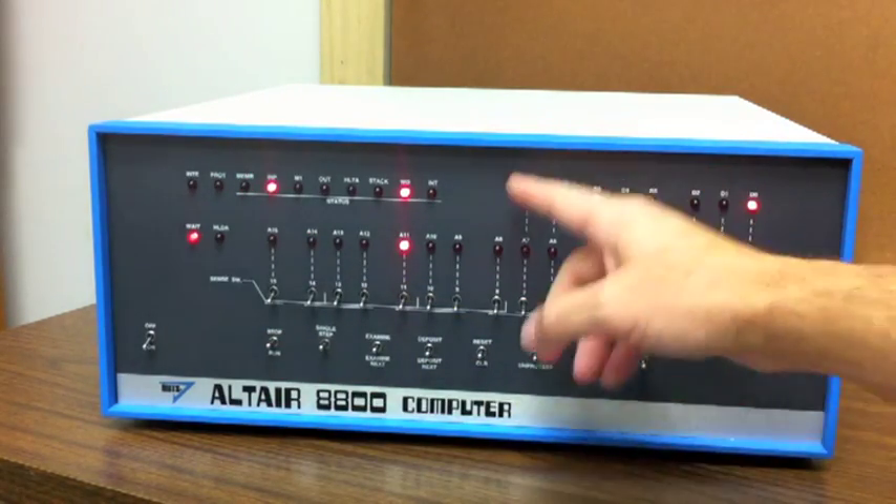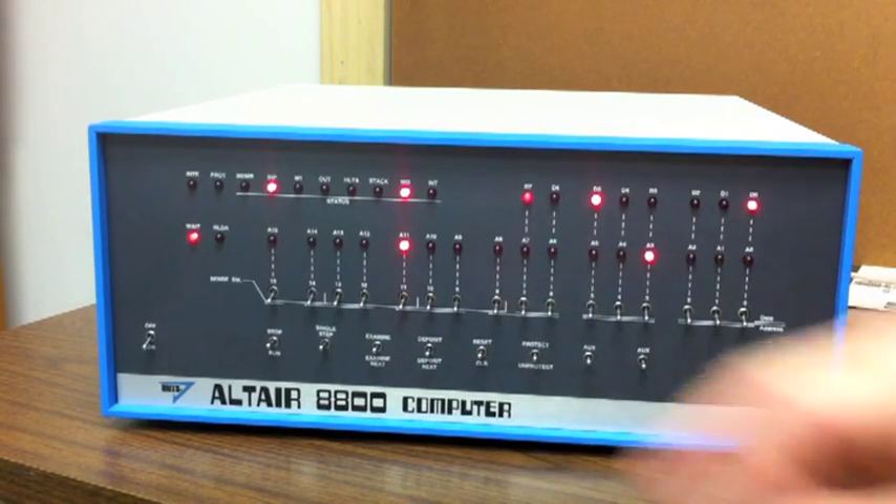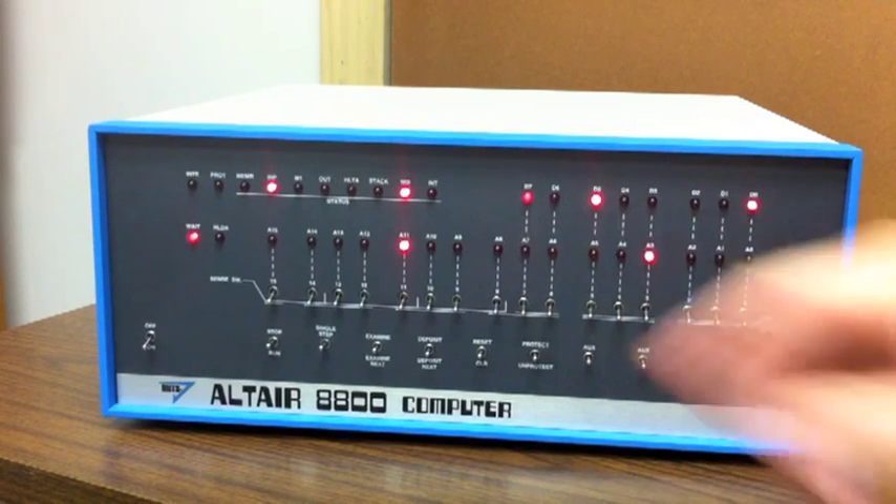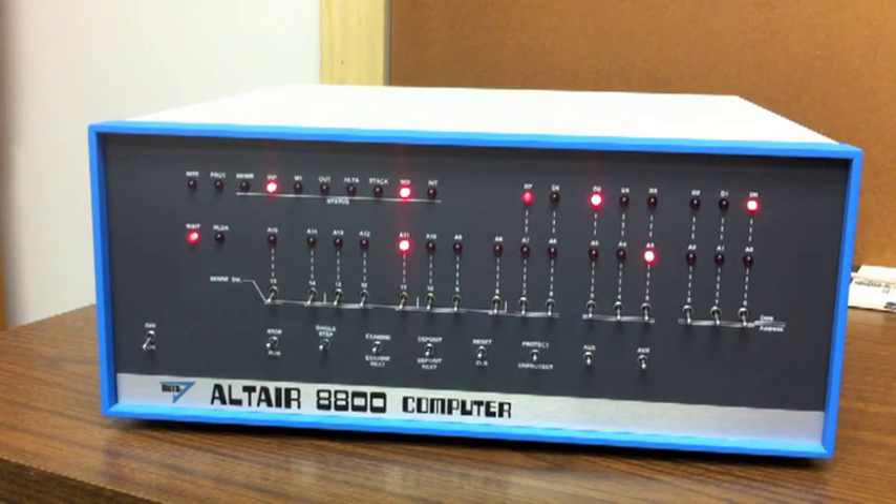Here's the input. This is not as exciting as the sector position register, but we can see that D7 is definitely dimmer than the other two lights that are on — that indicates there's some activity there. What we're looking at is a flag that indicates that read data is available from a data sector as it's going under the head.